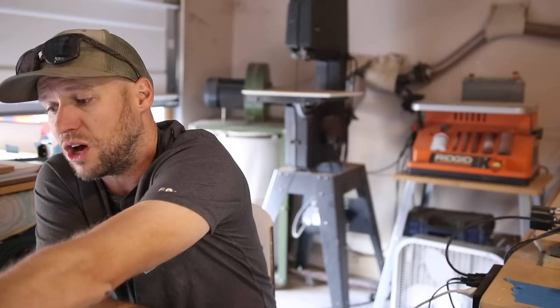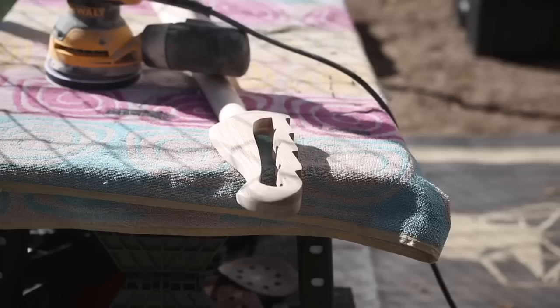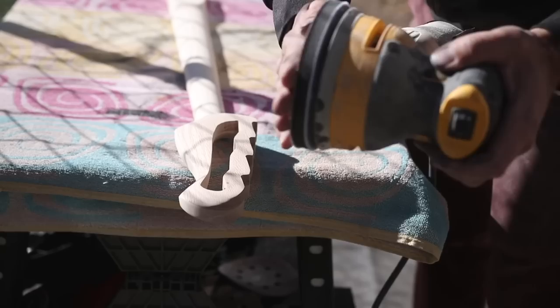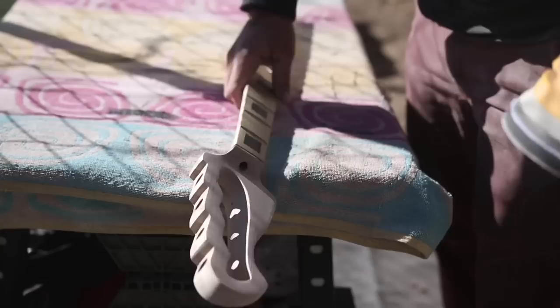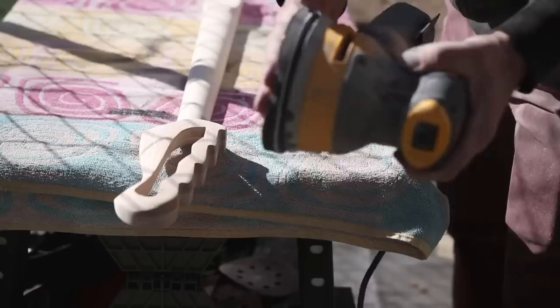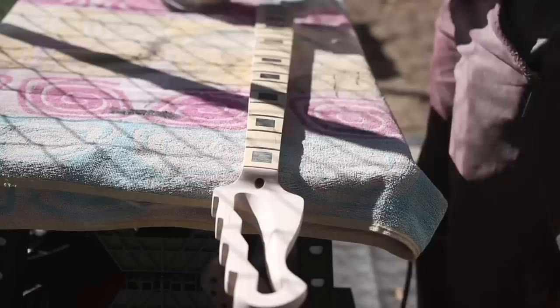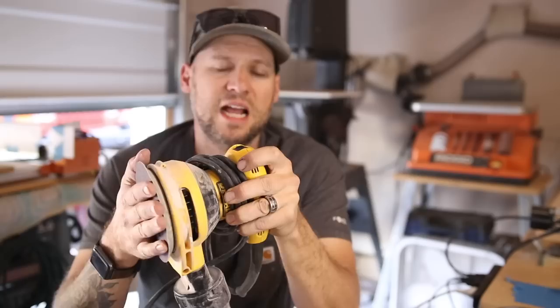Having two of them has actually been really beneficial because the next sanding accessory I'm going to tell you about goes along right with the orbital sander. And that's these foam sanding pad attachments. Because of my extreme distaste for sanding, I'm trying out another accessory — it's a little Velcro-on kind of spongy pad. I love the orbital, but one of the shortcomings is that it works best on flat surfaces. Curved surfaces, not so much. So this sponge is going to really help it contour. Oh, my goodness. That's amazing! That's incredible. That this one time was worth this purchase. I don't know why they don't come with these from the factory. This is so much better. All of these transitions — so smooth. Oh, I love this. It's really helpful if you're trying to sand something with contoured edges to have a foam attachment like this.